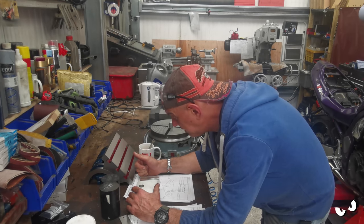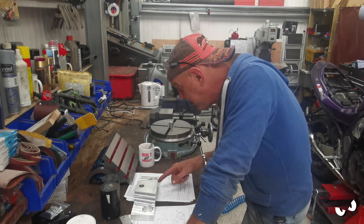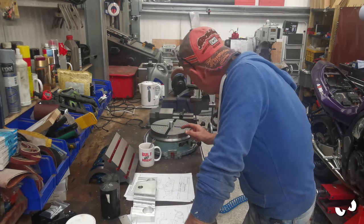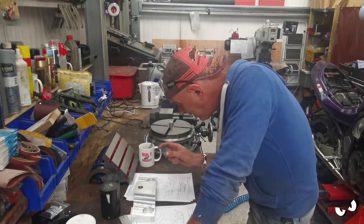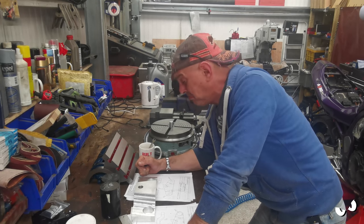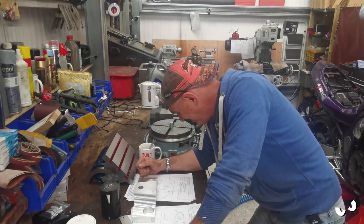The thing is, I'm having two minds about how to set the thing up. When I used the rotary table to tilt it around to do one of these radiuses on the inside, the first one that I did, I had it all lined up, dialed it all in, it was spot on here, but I think because there's backlash in the lead screw and all that sort of stuff, it didn't come in absolutely perfect, and I've not remade the nut on this yet. That's going to have to wait for a little bit. Once it's set, it doesn't move at all. It is brilliant. It's the setting of it that I'm freaking out a little bit over.